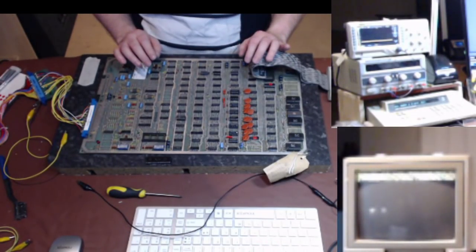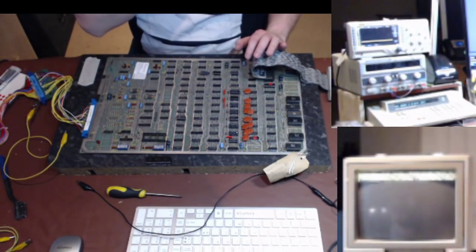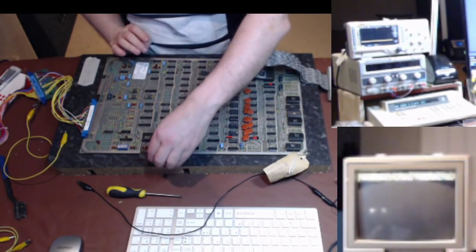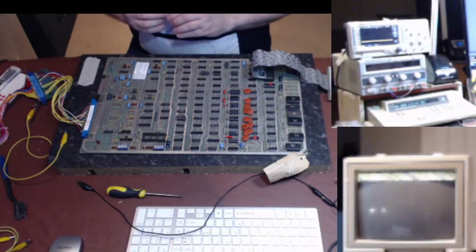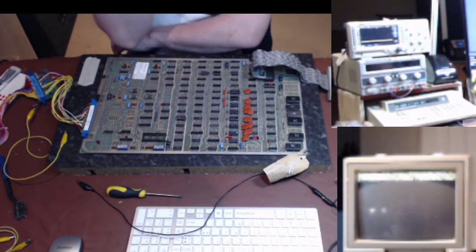So on the screen you can see at the top with garbage, that's basically Fluke's test pattern, but I haven't seen anything appear down here, which normally I would have thought there would, but there might not be any colour bit stuff loaded because the pokey chip's not present. I think it might get some data from that. I could be completely wrong, of course. Come on, finish your RAM test. If it finishes that, I'll power the board off, put the pokey chip back in and start it back up again and see if it'll come up in test mode. It's not complaining about the RAM. The screen sheet seems to be being drawn correctly.